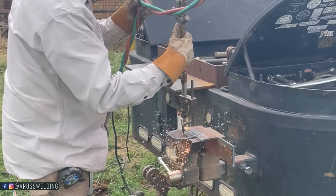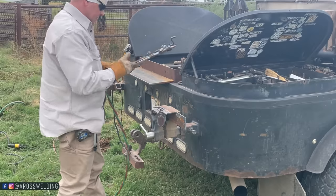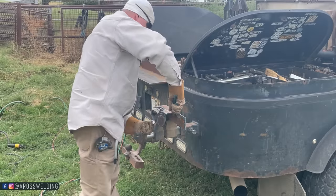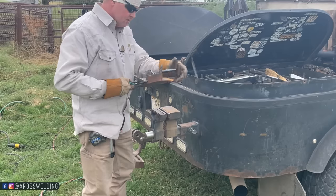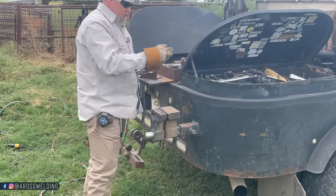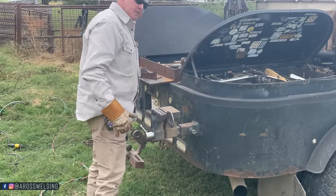I don't know if you can see it on camera, but the plate obviously bent a little bit because it drew whenever we welded it together. On this project, it's not a big deal because we're just capping a piece of pipe, and the way it bowed up top, the way water sheds off of it is easier. But in other words, it's a prime opportunity to learn or try to weld plate together and not get a bow in it, or whatever you're practicing. All right, now I'm gonna clean this up, go cap our post, and then carry on.